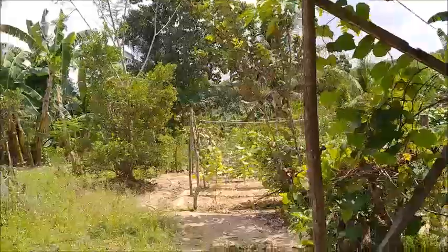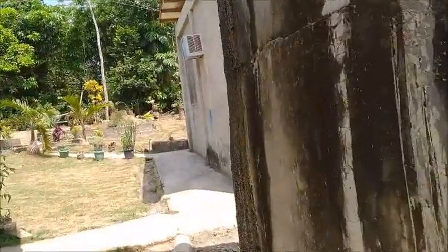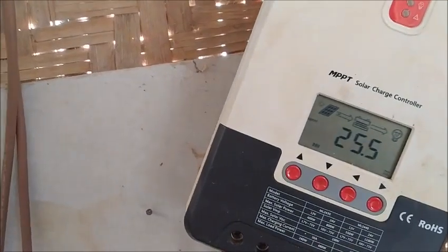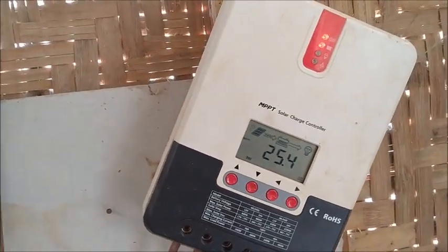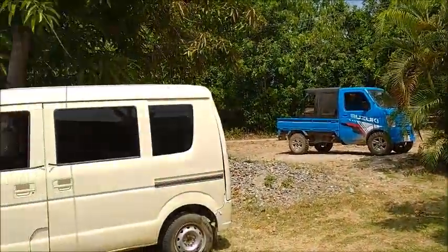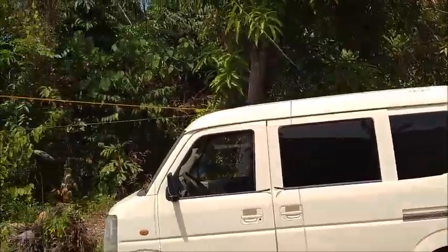I'm going to turn the pump on — I'm almost expecting to hear the voltage alarm come on by the time I get back up here, but it hasn't yet. At the moment I'm running the aeration, the water pump, and the refrigerator, and all the lights and fans in the house. It is dropping — how fast is the question. I want to fill up the water tank, which will require running the pump for about half an hour, then shut it off, switch back over to grid power at about 3:30, and allow the batteries to fully charge in the last two hours of sunlight — so that if we have an emergency overnight, we have power to at least run the aeration.